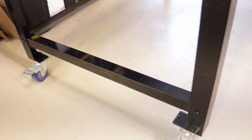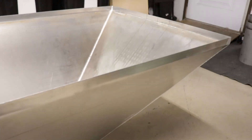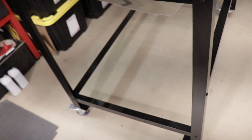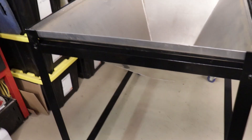Everything's just bolted together with quarter-inch bolts. I put the micrometer on it and it's basically 60 thou — I think it was like 61 thou. I didn't do the welding; a buddy of mine did it, welded inside and out. At this point the frame is still really very light and easy to move around. It might even be overkill with those wheels, but that's kind of the standard wheel I use for a lot of my stuff — I get them from Castortown. I think it's a urethane tire just to roll around nicely and not make quite so much noise.